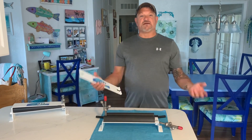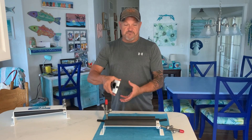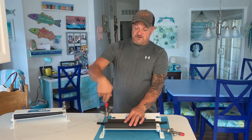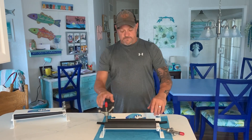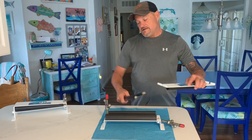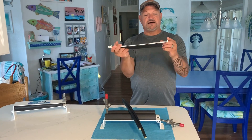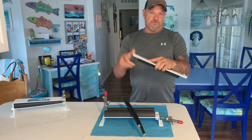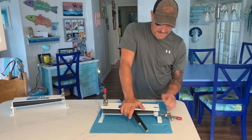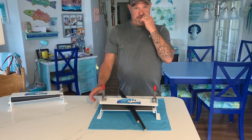This was designed for metro areas where larger bundles are a problem — you might have big six-inch groups of cable. These are six inches tall. Once you lay your bundle in, you get this down to where you need it. Lay your cable in — there's a lip on both sides so you don't get any slippage. Put this under the nut, tighten the backside down, put a little pressure on and get the other one where you need it. Those cables are going to be held in there securely.